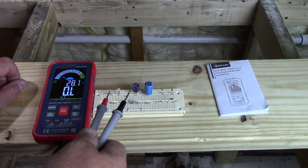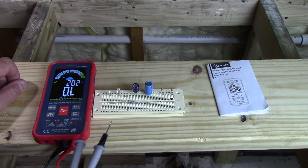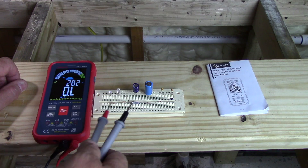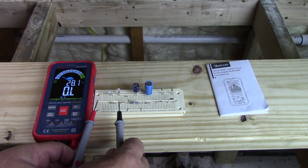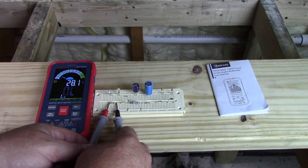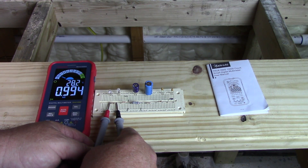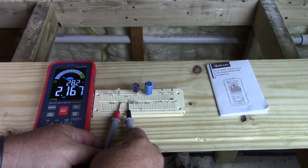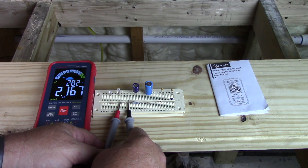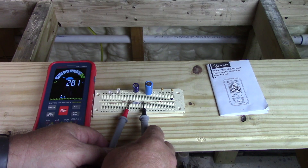I've set up a little breadboard to do some testing — I've used this meter all week and it's really accurate. I've got some resistors, LEDs, capacitors, and a diode. First we have it on ohms and we're going to check the resistors. The first one is a 1k resistor — testing it here and it shows 0.994k, which is pretty darn good. These are plus or minus 5% resistors.